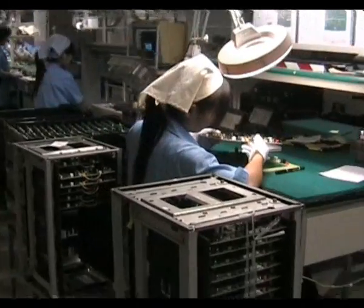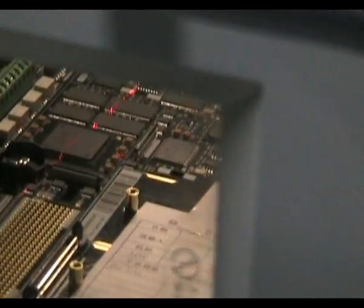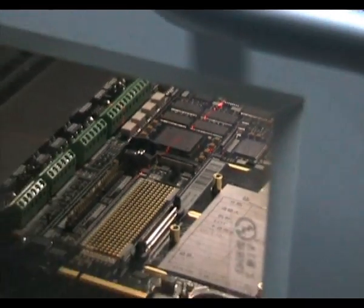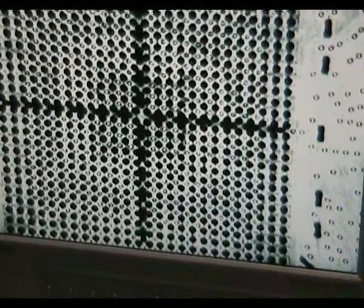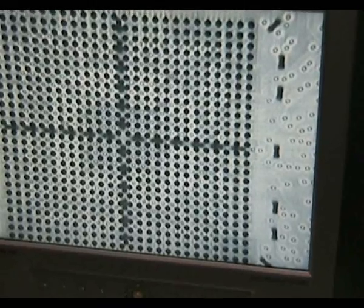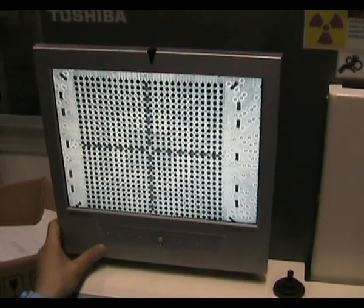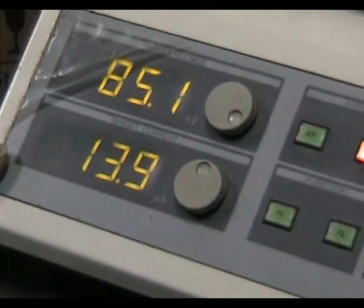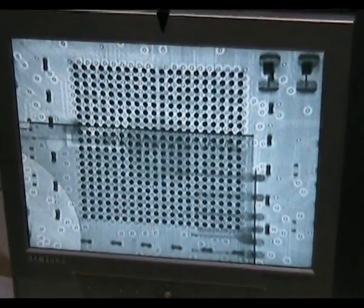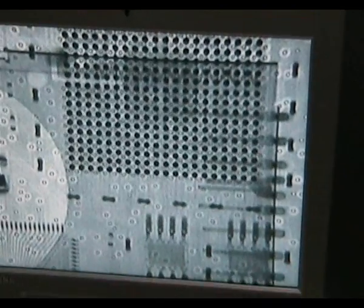Now we're taking a look at an X-ray machine. We're taking an X-ray of a 676-pin BGA device on the board in there. The X-ray machine is really quite neat — you can pan and zoom around in real time, and you can fade the image in and out. The idea is to look for any shorts between the balls and any discrepancy in colour between the balls, which could indicate a dry joint. This is an FPGA on one of our boards which we had a problem with. You can also see the shadow outline of an SD card on the opposite side of the board.